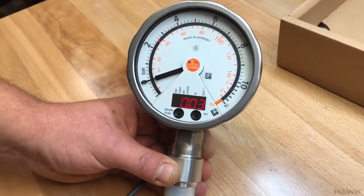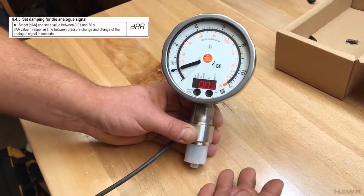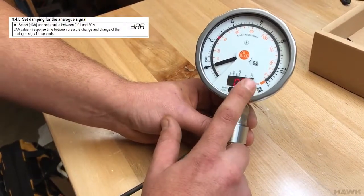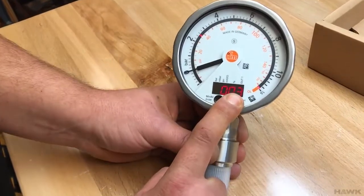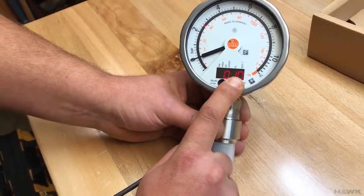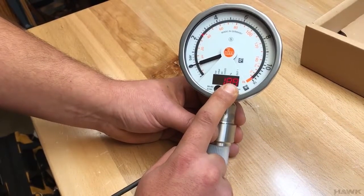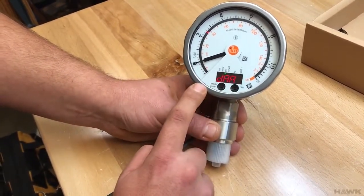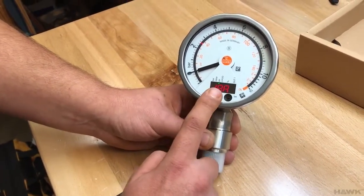This is how many seconds of data it averages together. This could differ based on your system and what kind of natural responses you're looking at. Generally, it's good to set this number to at least a second, maybe three seconds. The maximum is either 10 or 30 seconds. We have now set our units and our dampening, and we can proceed with standard set point setups.